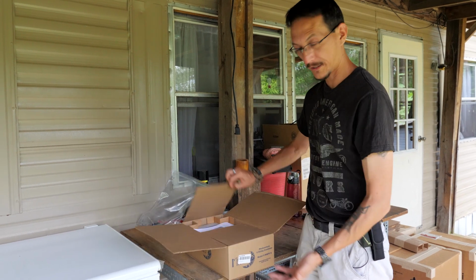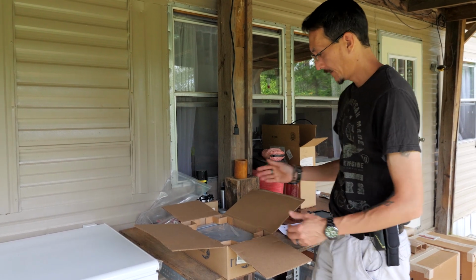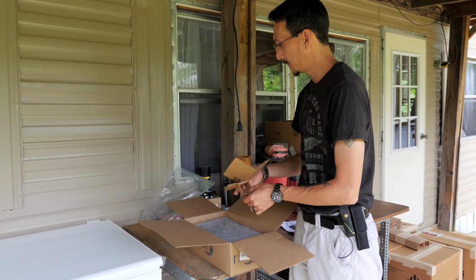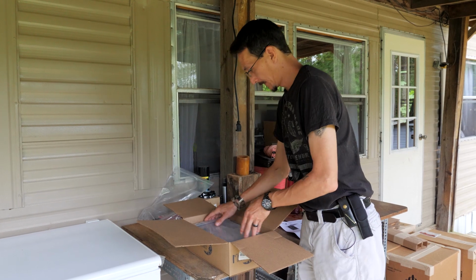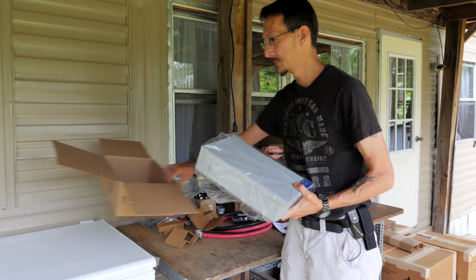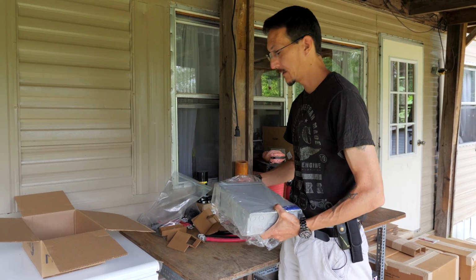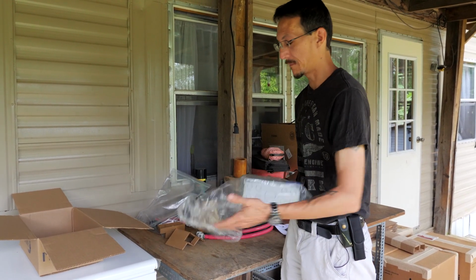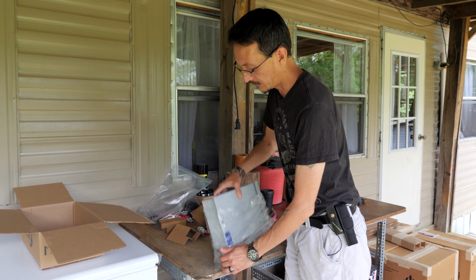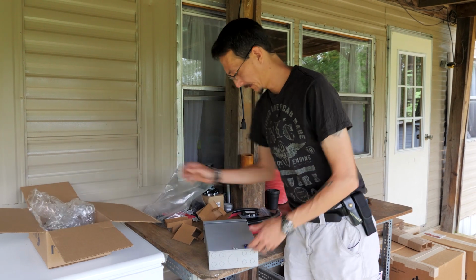Let's see what's in the box when you first get one of these. Got your instructions. There's a lot of different ways you can wire these. Like I said, this is a 6-position box. You can actually split the bus bar in half and run 2 separate systems in one box, but we're not doing that. We're using half of one of these boxes, and we're using 2 boxes, which gives us the ability to double our system later. So each combiner box will go into one charge controller. Our system is going to have 2 charge controllers.